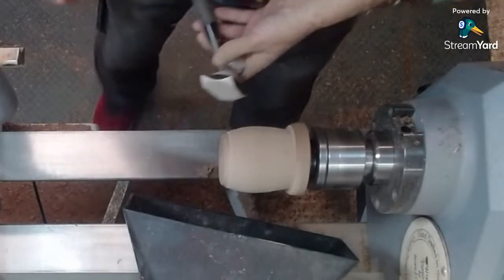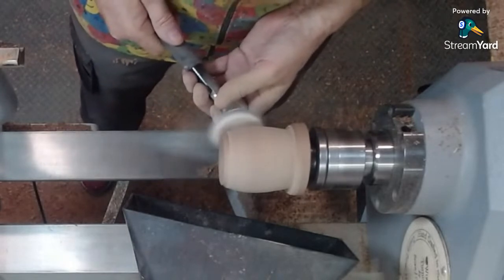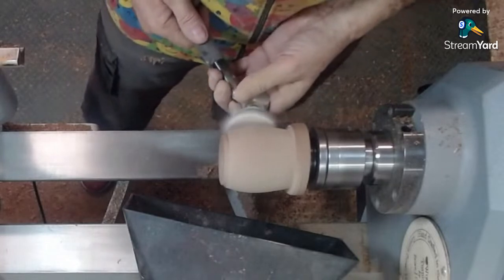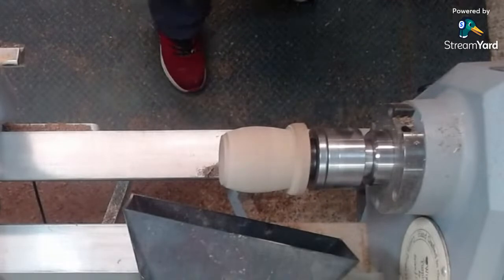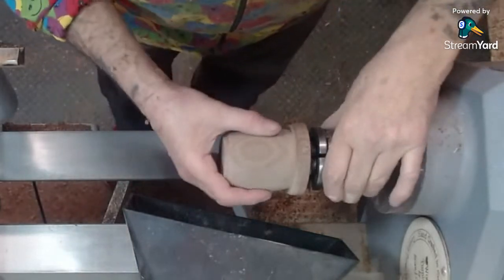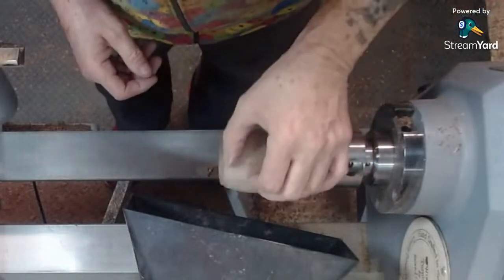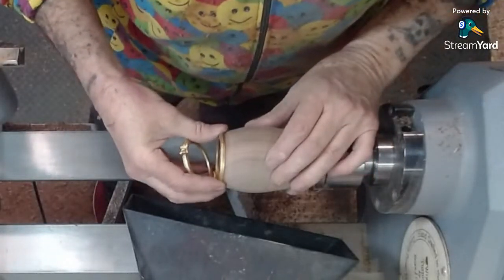I think I could turn the speed down a bit when I'm sanding, eh? Mind you, don't sand that tenon on the end for your hinge. Yeah, I haven't touched it. Definitely not anywhere near. And what is it you're sanding at the moment? That's 180, I think, because it's a nice, easy bit of wood and it's nice and smooth anyway. Off the skew, I just went to 180. Yeah, you could see the finish off the skew. It was getting a bit burnished. That's why I went with the sandpaper. Let me just check this again. Is that triple R, Brian? I think that'll be fine. Burnished.